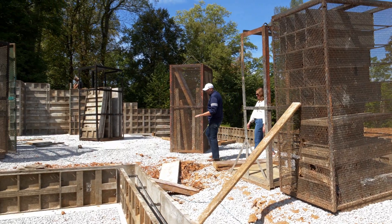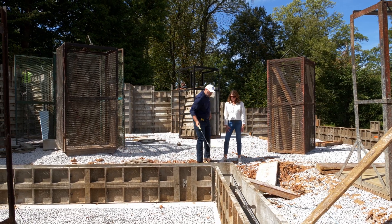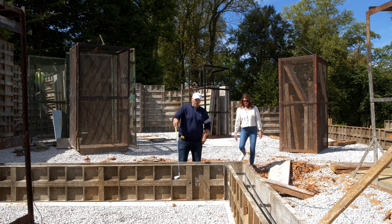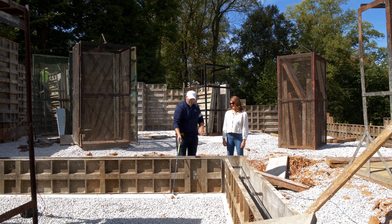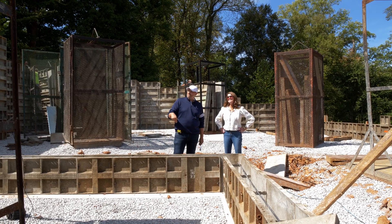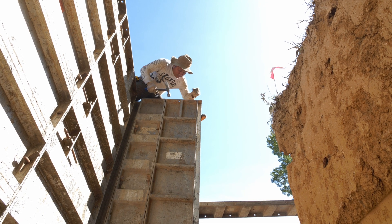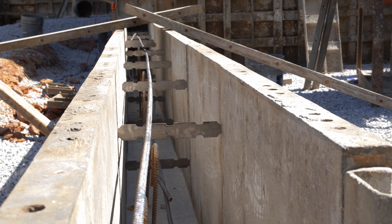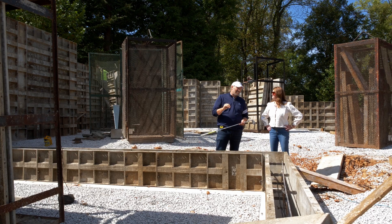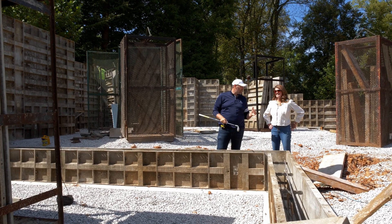This basement has a combination of 10-foot walls and 12-foot walls. Right here we're going to have a little two-foot step-down wall — you'll be standing in the main level of the basement and then there'll be two steps down into the golf simulator, or sports room — multi-purpose. That area has 12-foot walls, which is why we went up to a 10-inch thick wall. Normally we could go with an 8-inch wall, but we wanted extra support going that tall. We also alluded to a safe room — a concrete shelter, or panic room — which we'll show you now.